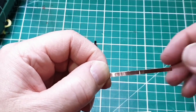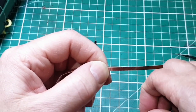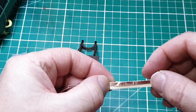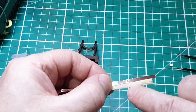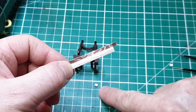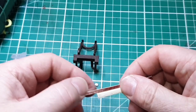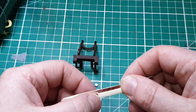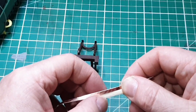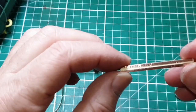So we'll look now at how I'm going to wire these onto this piece of wood. This is conductive copper. It's sticky back, so I can cut this to length and put a strip down either side of a piece of wood, leaving a gap between them so they don't connect. So I can solder one side of the LED onto one strip and the other onto the other strip, and then solder on two wires at the bottom, which then can be fed on to the 12 volt bus via a resistor. So let's get cracking on that.